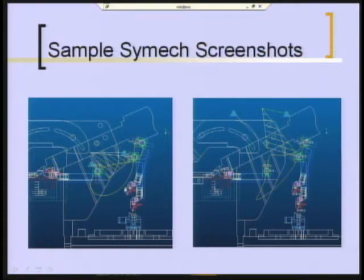So the coupler curve indicates the path through which the part, in this case the grabber, will move from position 1 to 2 to 3, and that changes quite drastically as you move the pivots around. If you've seen the coupler curve tape, you should have some understanding of that process in respect to how coupler curves vary quite distinctly with changes in linkage geometry.